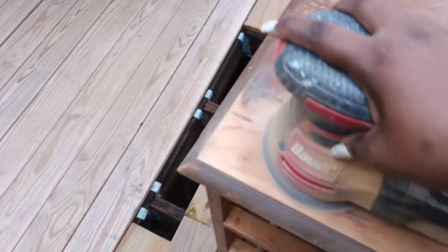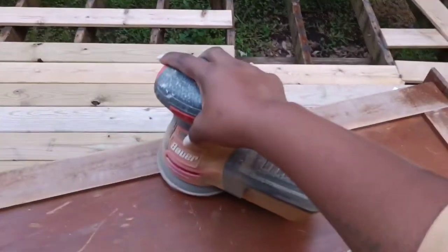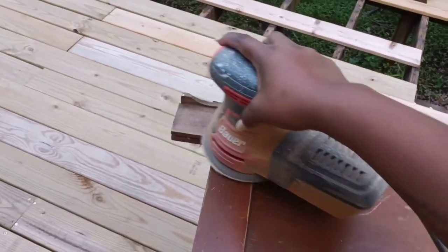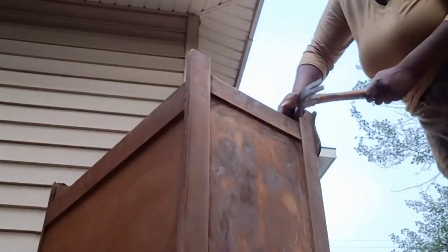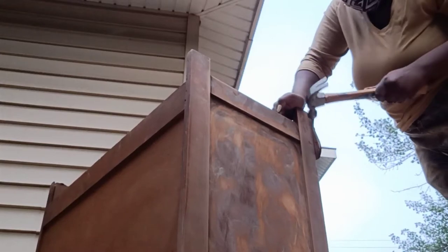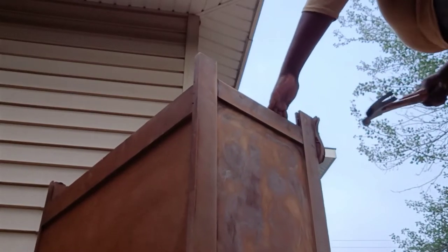I have been wondering if you guys would like a video on sandpaper basics — you know, like what grit to use for what and that sort of thing. So if you would like a video like that, leave me a comment down below and let me know. I then continue on with 220 grit sandpaper doing a scuff sanding on the rest of this piece, where I am not necessarily trying to remove all of the finish and get down to raw wood, but I am trying to remove the top coat and any remaining gunk and really just trying to give my paint a scuffed finish to stick onto. There was one piece of trim across the bottom and I'm just going to hit it with a hammer a couple of times and knock it off — it's just attached by a few nails and it's just one solid piece of veneer. It looked a little bit old-fashioned and it was damaged on one side so I just decided to remove it.